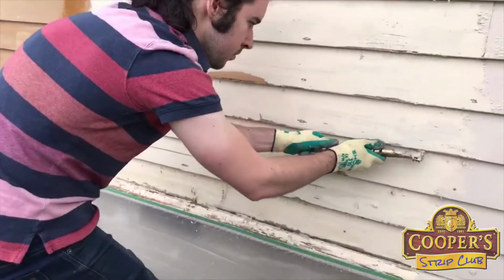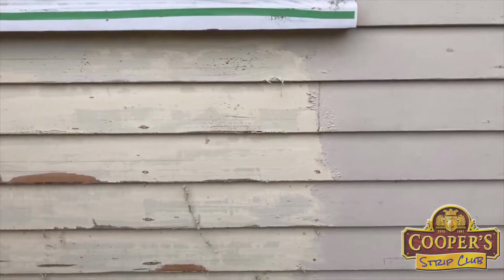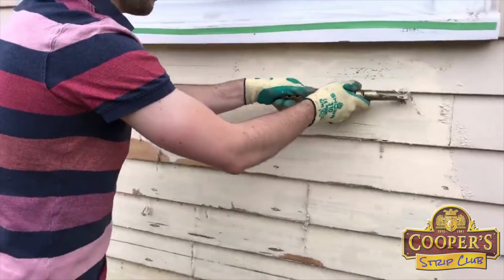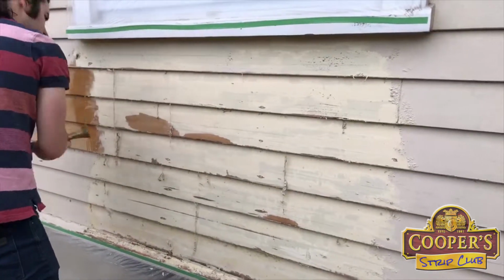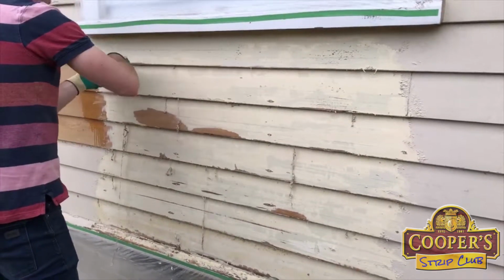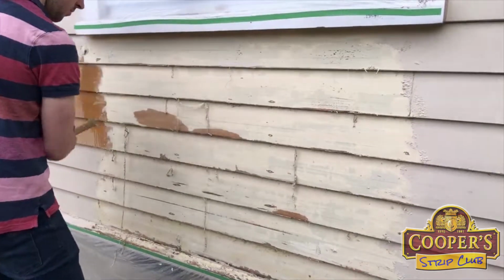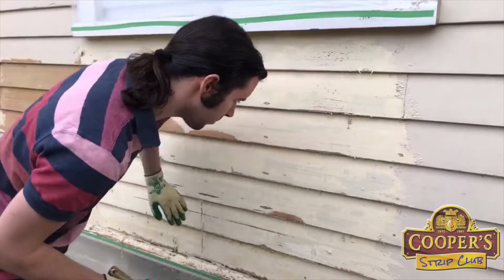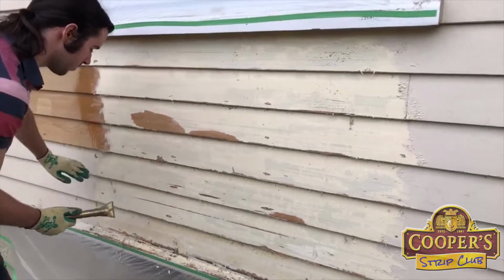We have a question from Daryl Clark. Hi Daryl. How many litres of stripper will you use for this section today? The sample I did last night, it came out to using a litre of stripper will strip about 2 square metres of surface, which is pretty good. When you look at your normal conventional strippers out there, when they're talking about 0.4 square metres per application, this is going many times the distance.